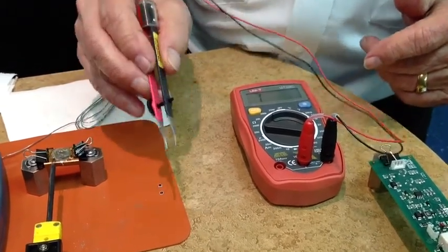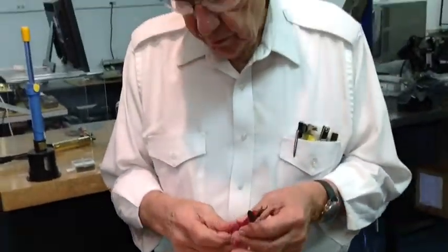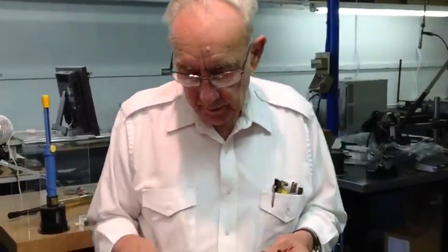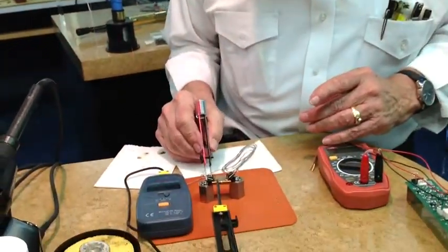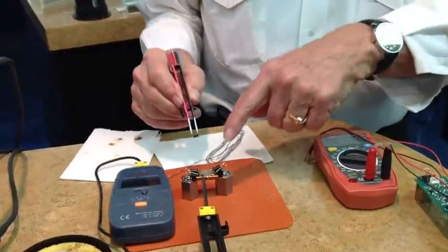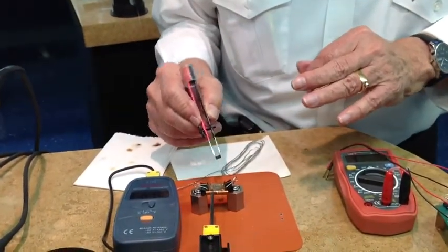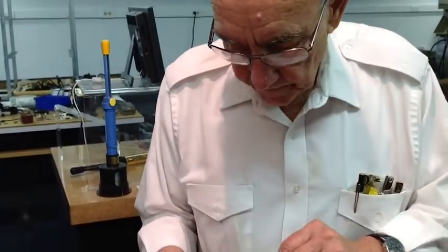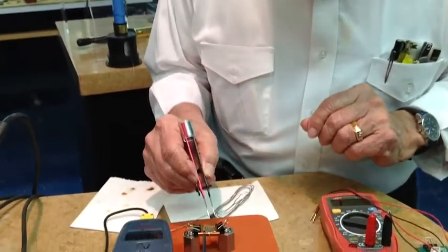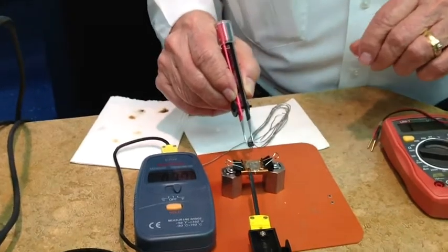You can use these probes to put components back on with the hot air. But right now, we want to use these probes and check out a particular device for taking it off a thermal load, which we don't know what that load is. We're going to take this and melt it onto this copper plate, which will simulate the circuit board that this component is on. We're also going to check the heat around it so we can gradually heat the area rather than thermal shock the component all at once.